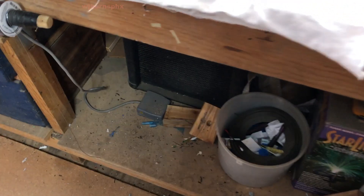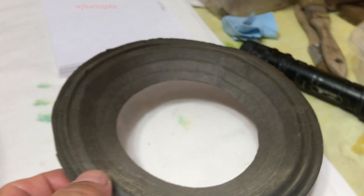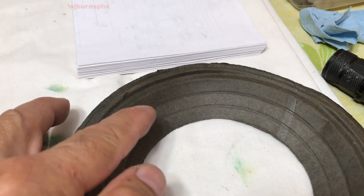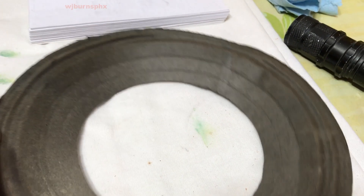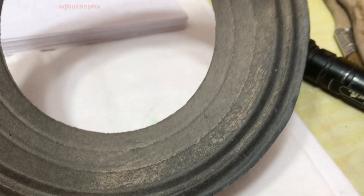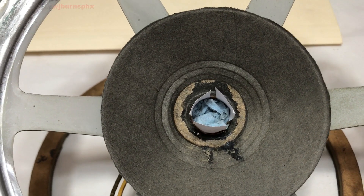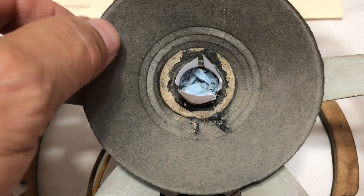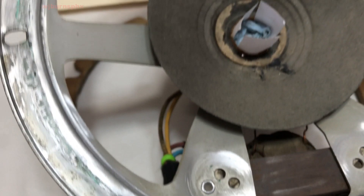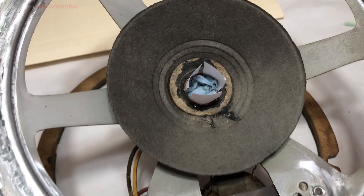Let's see — oh, there it is in the circular file. It has some... I don't know if you can tell at this angle, but right through there — that thing is all worked up, starting to crack. So once I pulled the dust cover off and checked it real closely, I could see it was rubbing pretty good and I was getting some horrible sound out of it. After a little play I managed to free it up somewhat and I was getting a better response out of it.